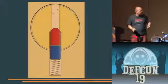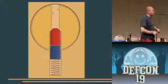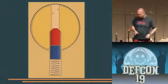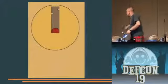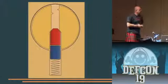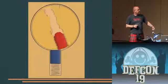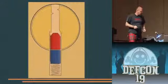In this picture, you see a bit more material in the red, and there is a blue piece of metal in play all of a sudden, and there's a spring underneath it. And we can now see why the yellow bit can't turn, because there's blue stuff in the way. So it's in the way. If we have a means of getting that out of the way, then you can actually open the lock. No rocket science at this point.